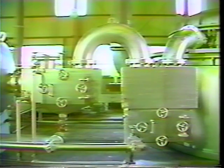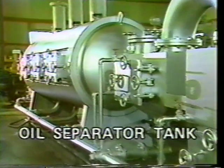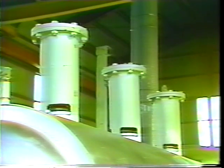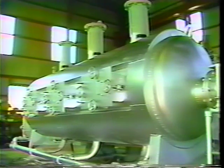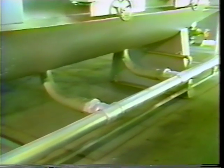The oil sludge heated in the vacuum kiln is sent to the oil separator tank as a vapor. This tank is composed of a three-oil separator chamber. The outer shell has a double wall construction and water is circulated around the tank to cool the oil vapor and change it back into oil. The oil is then saved. An outlet to remove the oil is located in the bottom of the tank, and this oil can be reused as fuel oil.